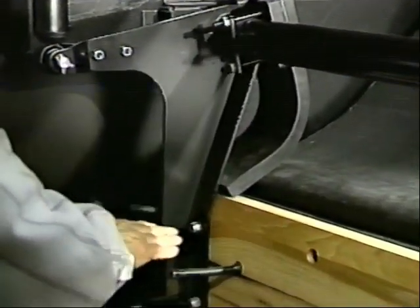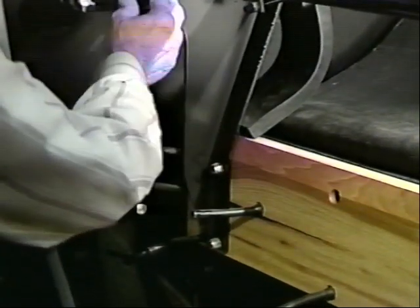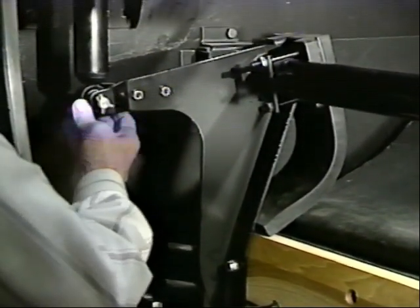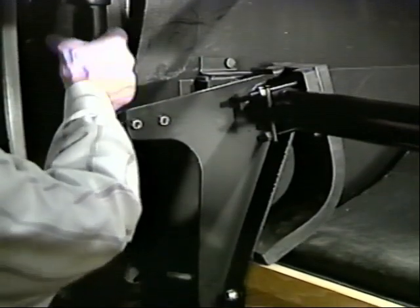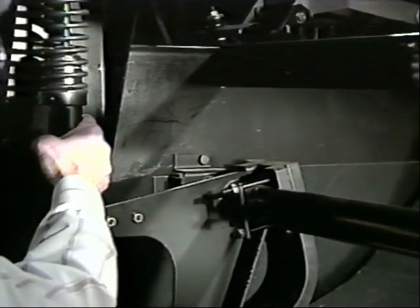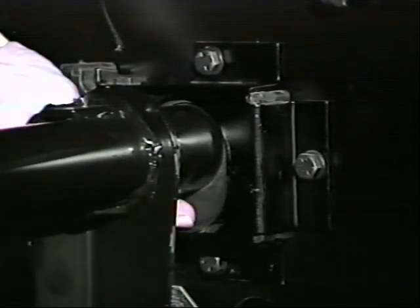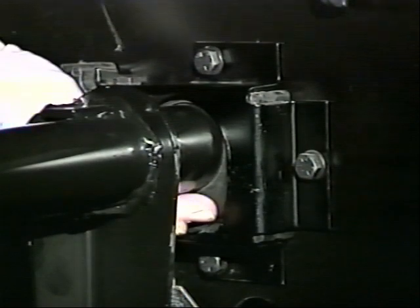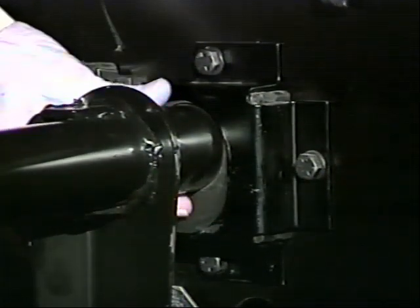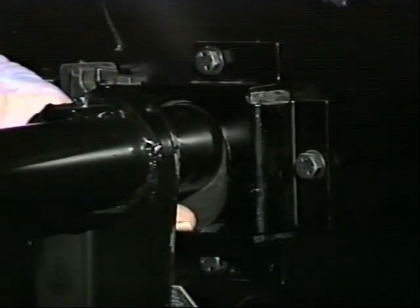We would look at hardware — making sure that there are no bolts that are missing or loose, following on up to where the ear is attached. We would be looking at the condition of the grommets of the shock absorber and the position of the spring on the shock absorber itself. The cushion hanger is supported on each side of the machine in a rubber block, so we would need to inspect this rubber block for wear. Wear in the block would allow the cushion to lower.